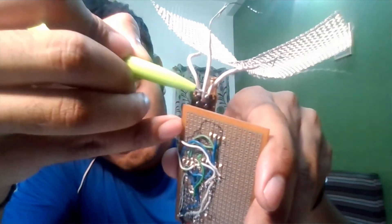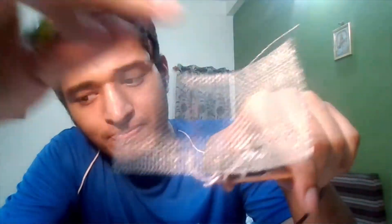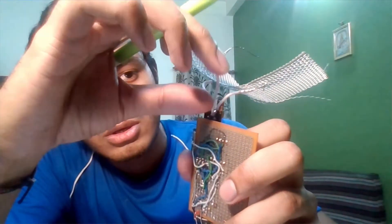The middle one is actually the feeder, which is where the signal comes from. What you have to do is solder one wire to this feeder and take it straight upward like this. Remember not to make this distance too far — it must be as short as possible.